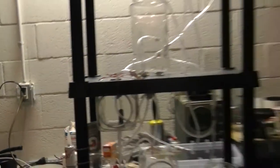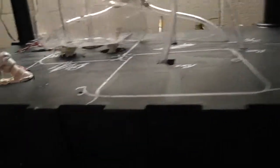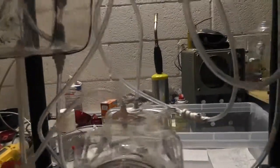What we have here is a way of keeping the tubes upward. Beforehand, these tubes were just dangling about — here at the midpoint instead of all the way up where they should be. Unfortunately, especially with this input tube right here, it becomes submerged under water. If it's not high enough, when the pressure phase comes — when this suction tube becomes a pressurizing tube and starts giving out positive instead of negative pressure — it's going to push the water back down the tube into the feed tank and nullify everything. You're going to have this half-full tank and it's not going to work very well.